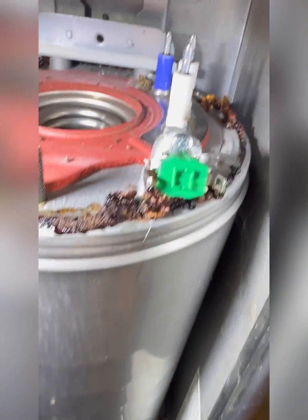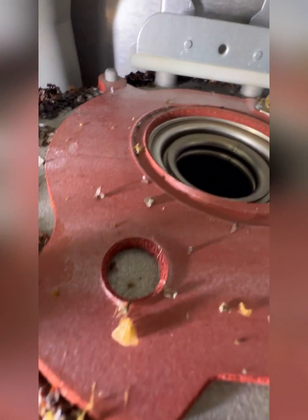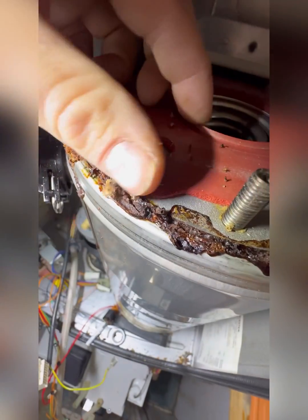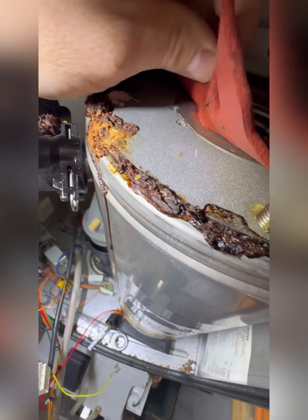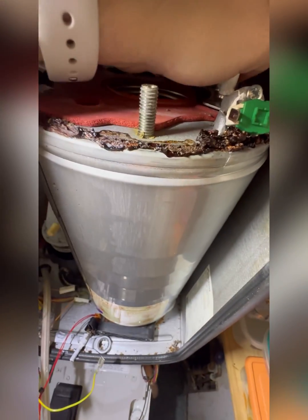With the clamp lifted out of the way, you can actually see that all that crusting is nowhere near the burner gasket. The only way you can tell if a burner gasket's gone is with an analyzer — if it's giving out CO. In extreme cases you can see scorch marks at the side of the case, and the electrodes and flame rectification probe will be all brittle. That's an indication, but you'll never be able to see visual signs like this.